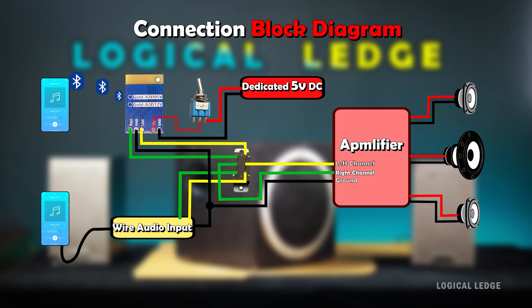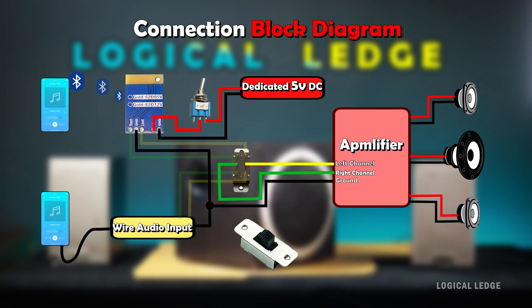From the slide switch, the main left and right channel audio connects to the amplifier. All ground lines must share the same connection. The slide switch operates as a mode switch between Bluetooth and wire mode. When the toggle switch is on, Bluetooth turns on. Slide the switch up to select Bluetooth mode and the sound plays. Slide it down for wire mode and the sound plays. If the switch stays in the middle, the sound will stop.